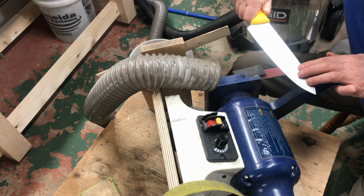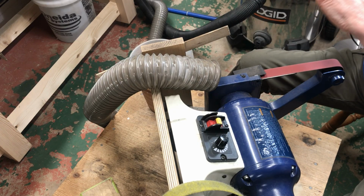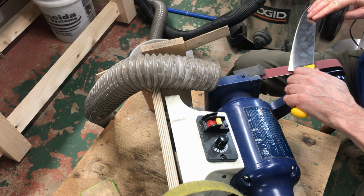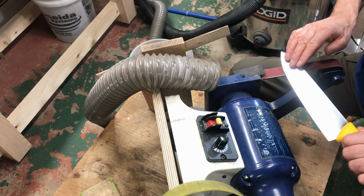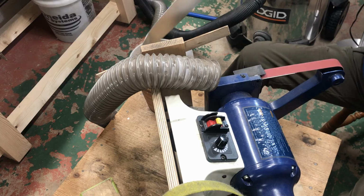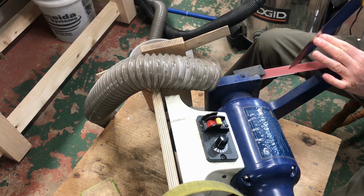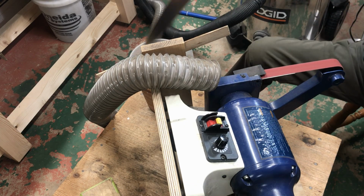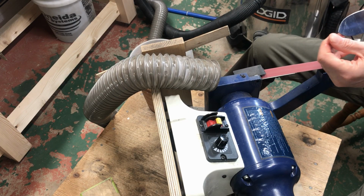As we're going, we are already well into apex on most of the edge and creating an enormous burr, which we will remove in a little while. So here I'm just taking note of the tip. I don't want to grind it up endlessly into thicker metal, so I will try and match the existing shape of the spine of the knife and bring the spine down to the point. This just keeps the cutting performance at the tip a little bit better.